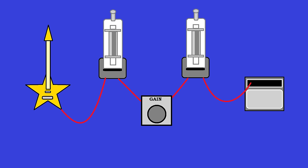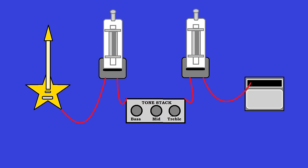If we're gonna get rid of some of that gain, we might as well make it do some work on the way out. Put it to some use. And for this, you need a tone stack. This is basically an equalizer for the preamp. For the most part, the design of a tone stack is why a Fender sounds like a Fender and why a Marshall sounds like a Marshall. Now, I do understand that these devices may use different types of tubes, different types of circuits, but the majority of that signature sound for every brand or type of amplifier is coming from that tone stack.